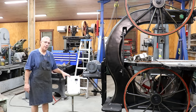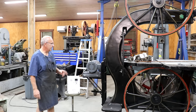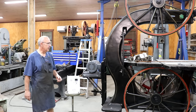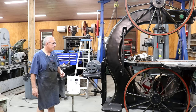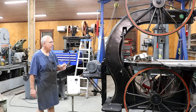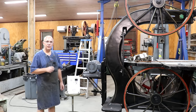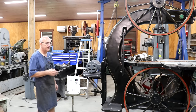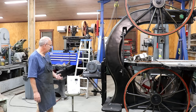We also can put a potentiometer in here — just one of those little dials that you turn to get speed control — and I think that's going to be very helpful. According to the catalog, this thing's supposed to run at about 450 RPMs, which is a pretty fast surface speed, particularly on that four-foot diameter wheel. With that speed control dial, we can actually speed it up or slow it down to get it cutting just like you want and where the operator feels safe and comfortable running it. It's not just one speed for everything.